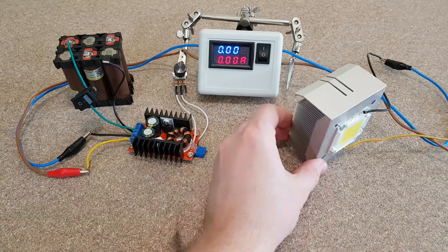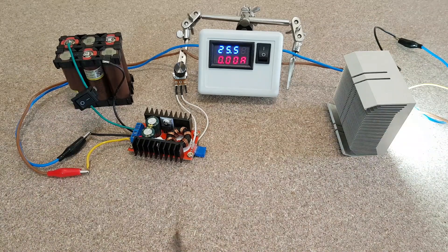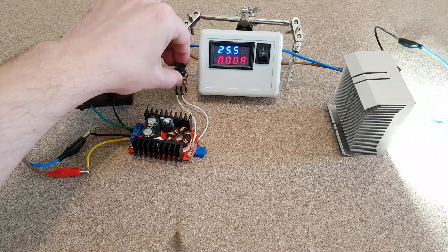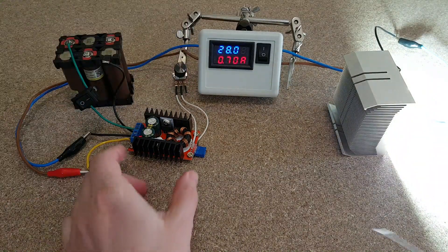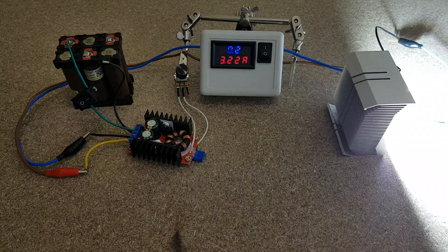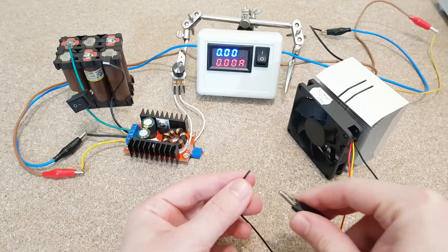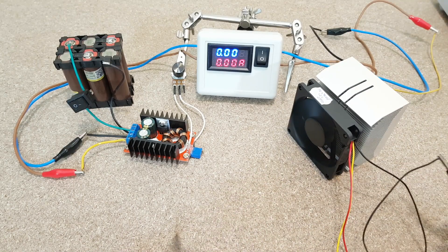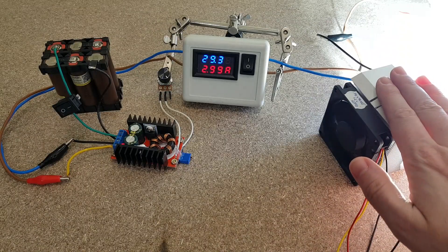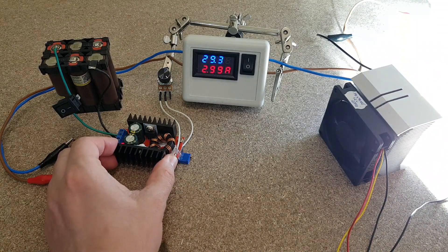I need to carefully set the two potentiometers. The LED is temporarily fixed on the heat sink — I will use my DIY volt/ammeter to measure the voltage and current going to the LED. The secondary 1 kilo ohm potentiometer will modify the output voltage by only about 2.5 volts — I will set it to maximum now. Then I will adjust the primary potentiometer until the voltage reaches 30 volts. But the current keeps going up — oh, the heat sink is very hot. I will add the fan and power it with 10 volts. Now the current consumption remains stable at 3 amps. The LED, heat sink, and step-up converter are warm — that's ok. The cooling will be better inside the flashlight.